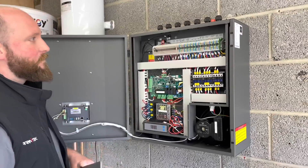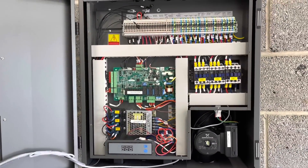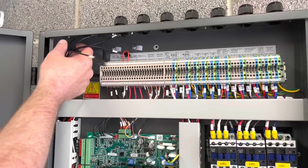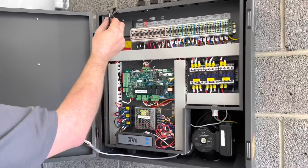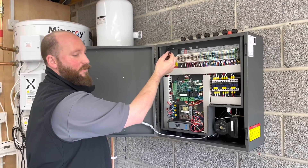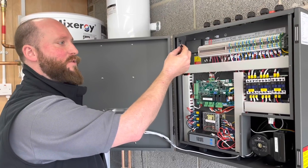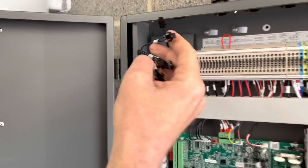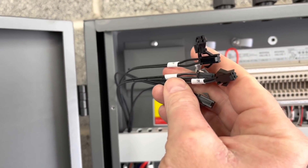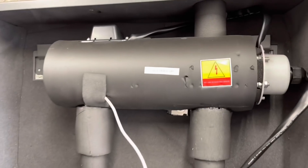Underneath this cover are all the electrical connections. These little guys here are all your sensor cables. With this kit there's no need to actually have to wire them in — they're just labeled plugs and they correspond to sensors out of the sensor pack. We've got system flow, system return temperature so you can set your deltas up, a hot water cylinder temperature, and a couple of others. There's not much to unplug if you want to lift it out of the way.